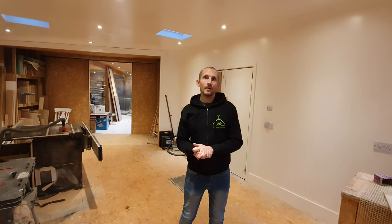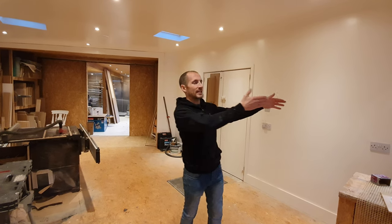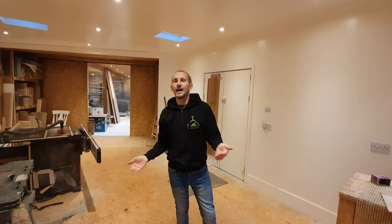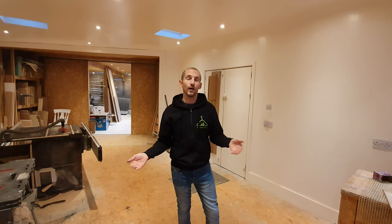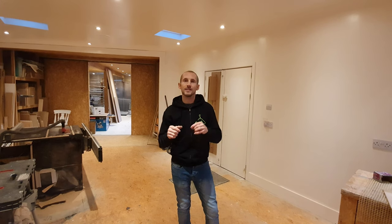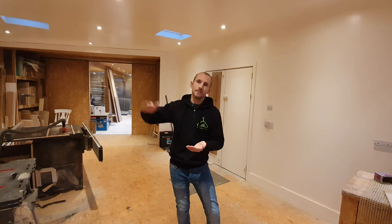So what you see at the moment are warm white. I'm trying to change to more like what you see outside. Nice and bright, natural light, daylight. The difference between the bulbs is that the bulbs we've got at the moment are 2700 K, or Kelvin, I believe, which is the temperature. So the temperature determines the color. The higher we go with the temperature, the lighter and brighter it gets.